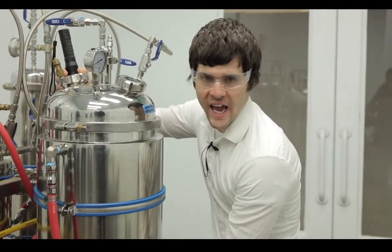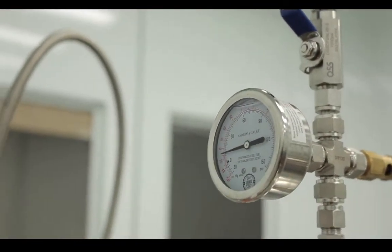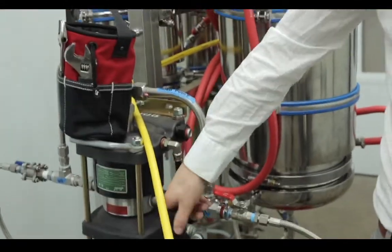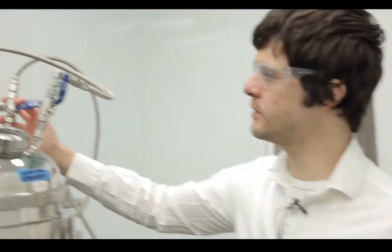So whenever the level of gas has almost completely evaporated and we can see the pressure drop on both gauges, this gauge and this gauge, we know that we are about ready to stop the recovery distillation process. Now that we have completely recovered all of the gas during the distill process, we will shut off our Haskell pump. Close our red stop valve. And then we will bleed any excess pressure, being sure to watch our LEL meter.